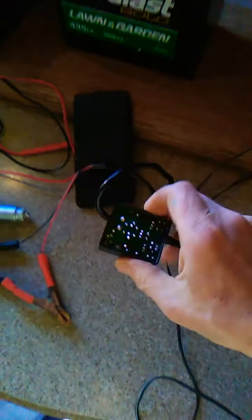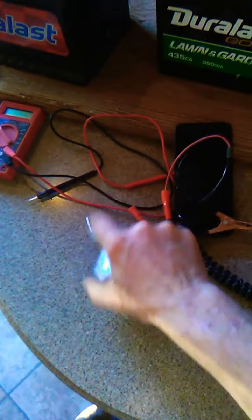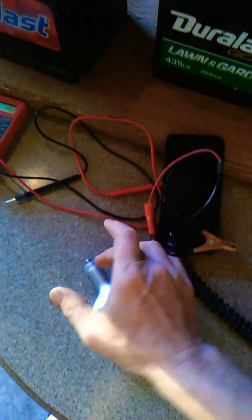You're not going to need the circuit board with the AC plug-in, so you can go ahead and nix that. What you're going to do is simply do this with one hand. You're going to come from before the box here, you're going to cut off, and trace back from positive and negative to which wires you're using. You're going to use the multimeter to check them. This is going to be the positive, this is going to be the negative. You're simply going to go from negative on both sides to positive on this side, and check it with a multimeter.